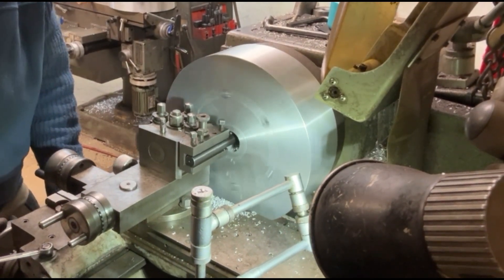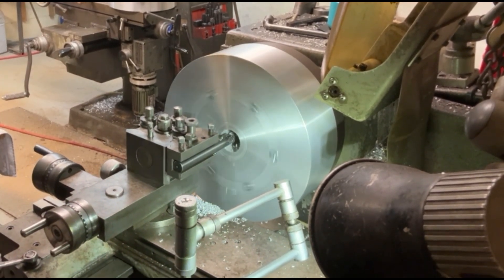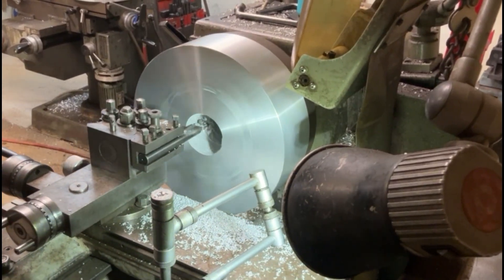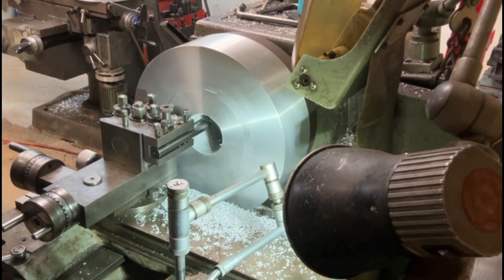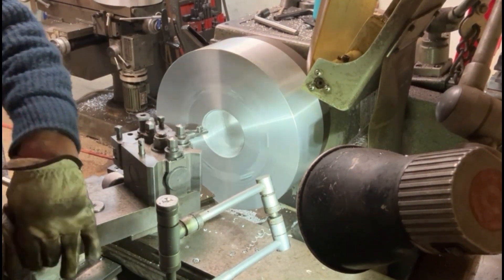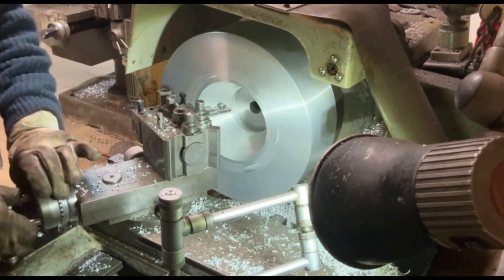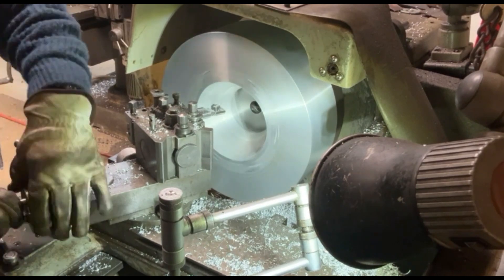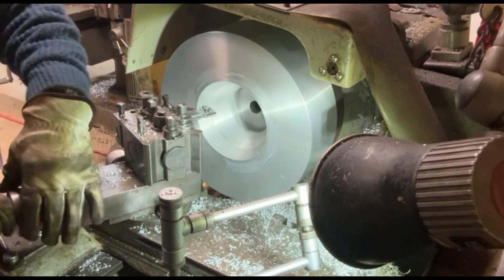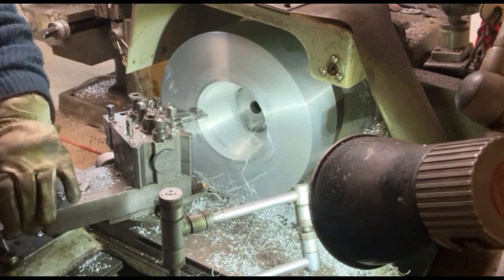Here I'm just beginning the boring procedure — running a hole through the middle of the billet — then boring out to the right size, boring out to the full core diameter of the interior. The next step is to start boring out the cone shape. It's 25 degrees, so here I'm getting a little bit deeper into the cone. I'm having to wind it all by hand. There's a little bit of side play on the tool post itself, but it's going through okay.